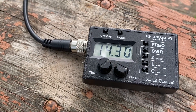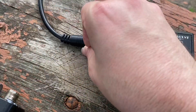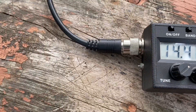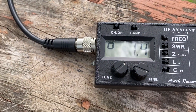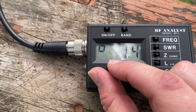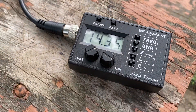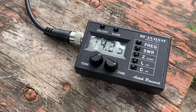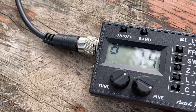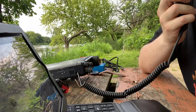The other end of the coax is now plugged into the antenna analyzer and I've set the frequency to 14.3-something megahertz. The SWR came back out of range high — a bad sign, probably meaning something wasn't plugged in correctly. It turned out I just hadn't tightened the coax enough. What I'll usually do to tune up is sweep around with the frequency adjustment until I find the point of lowest SWR — it's about 1.3-to-1 there. We're spot on band. If it were too high a frequency I'd know the antenna was too short; too low and it's too long. Dropping down to the CW portion of the band at 14 MHz, the SWR will be 1.5 — a nice decent SWR range over the whole 20-meter band.